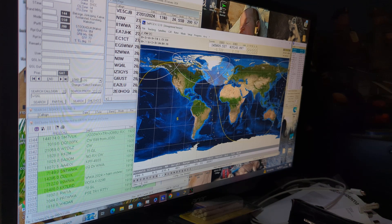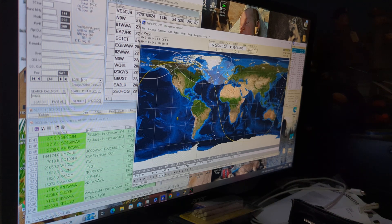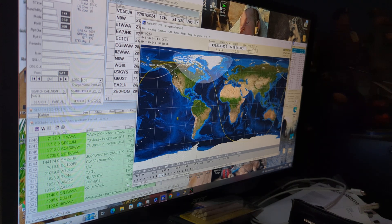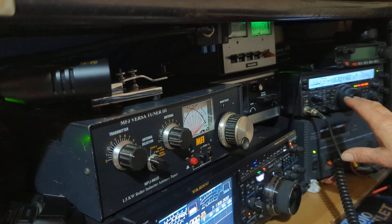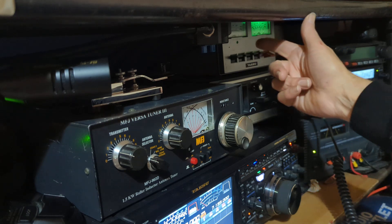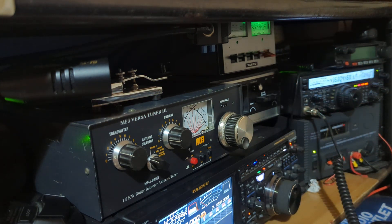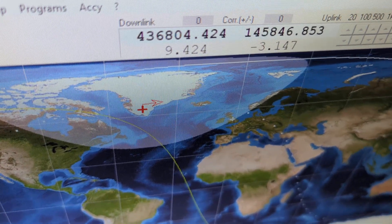Calling M0YKS on XW2C but not really picking much up - that's on 435 and it's a little bit hit and miss right now. The one I'm looking for is SO-50, which should be a bit more successful - that's on FM. I'll be moving along with this radio, the FT-847 as usual, running through the azimuth elevation rotator system - minus one lamp which I'll have to replace - and there's the small interface just tucked around there, driving everything via CAT cable from the PC.